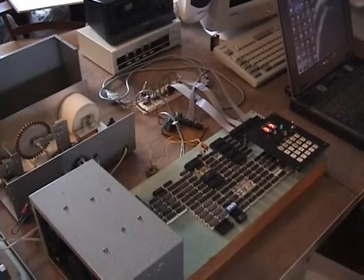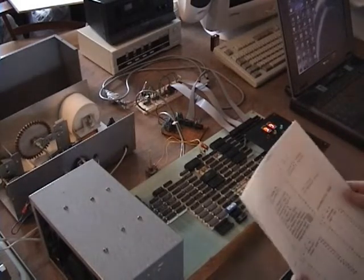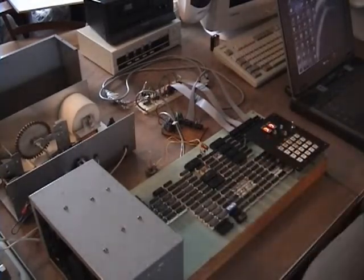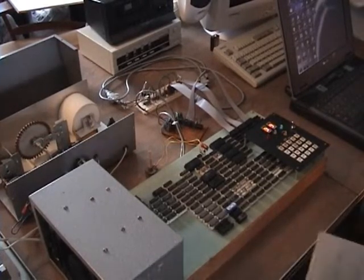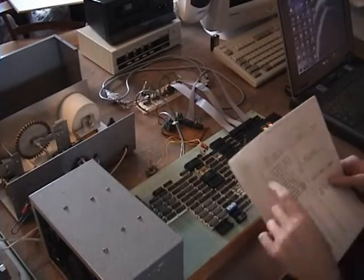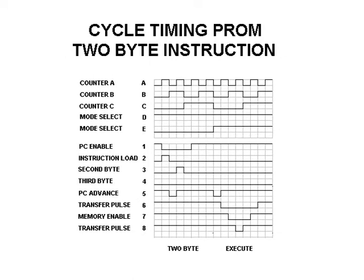And that's the main comparator. Of course, you just put in 2 numbers, and then the branch control takes a look at what the result is. Even though there are 3 different modes and they use different numbers of bytes, all instruction cycles are 16 cycles of a clock. So all instructions take the same amount of time at a given clock rate.